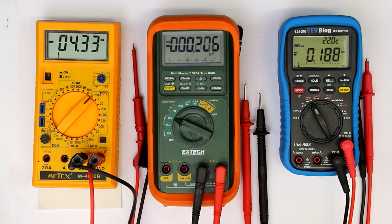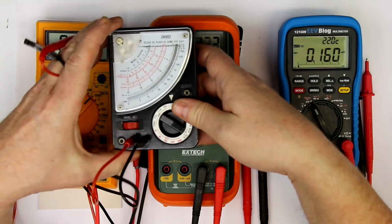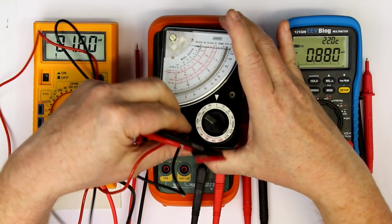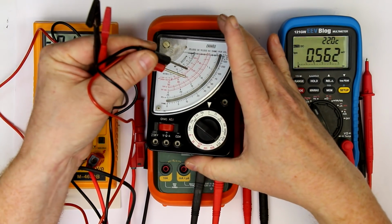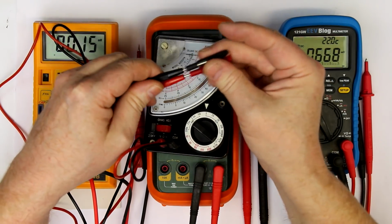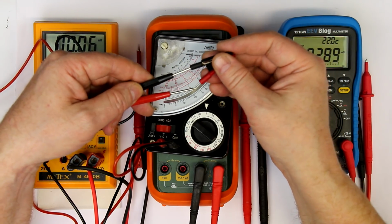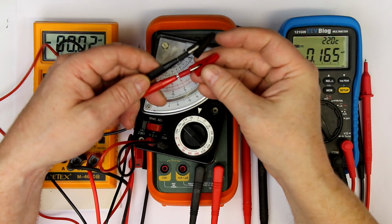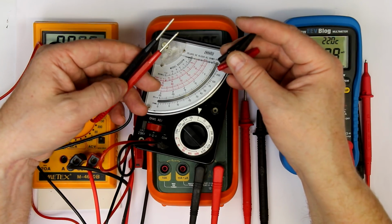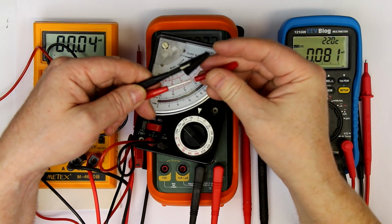them. Let's compare this to what you got in the 1960s or 70s with this analog multimeter. There you did not have 4 millimeter, but in fact 2 millimeter cables, and these are also of extremely low quality. Well, a nice feature is these mini alligator clips that you can clip on them, but today I would never work with such low quality probe cables and probe tips.